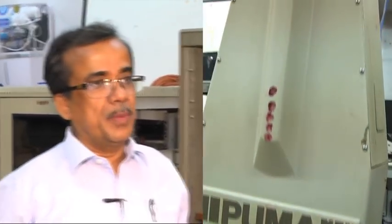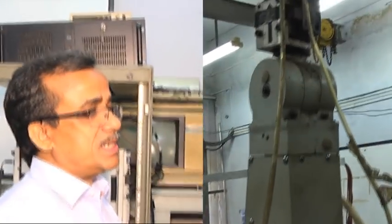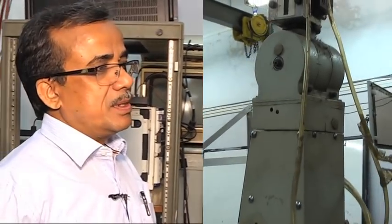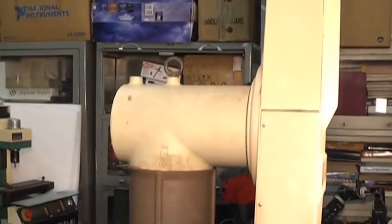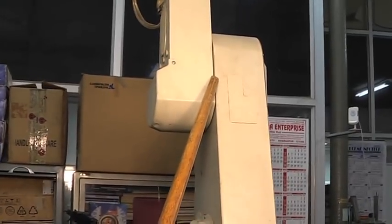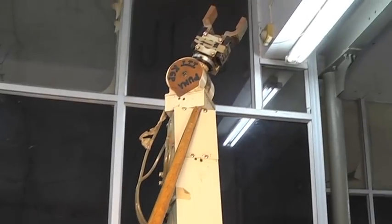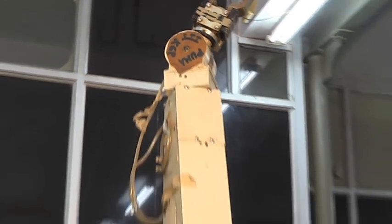We are going to discuss how to teach a robot practically. The robot we are going to consider is the PUMA — Programmable Universal Machine for Assembly. PUMA is a serial manipulator having six degrees of freedom. There are six joints, all six joints are rotary joints, and out of six we have three revolute joints and three twisting joints. This is actually the PUMA — a robot with a fixed base. The first joint is a twisting joint, the second joint is a revolute joint, the third joint is another revolute joint, the fourth joint is a twisting joint, the fifth joint is another revolute joint, and the sixth is another twisting joint. So we have six joints, each joint having one degree of freedom — this serial manipulator has six degrees of freedom.